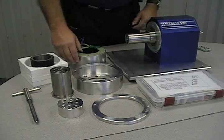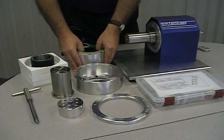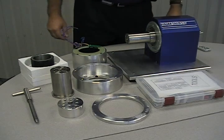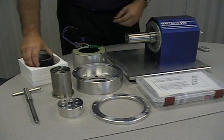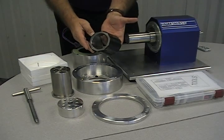We will review the parts included in the demo unit. The KBMS series of frameless motors consist of two parts. First, we have the stator assembly, which is the electromagnetic portion of the motor. Next is the rotor assembly, which is the permanent magnet portion of the motor.